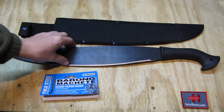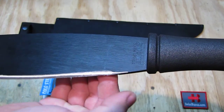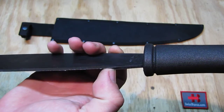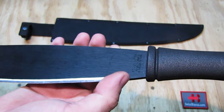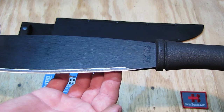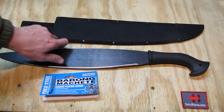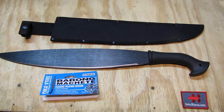What is also not ideal is the grinding line here — we can see they slipped a bit. The bottom grind line goes to here, the top one goes to about there. I'm going to rework that part a bit. It works as a tool, but when you resharpen you would like a sharper edge where the sharpening stone actually starts on the item. I'll do that quickly on the grinder — just need to make sure not to overheat the steel — to get a better starting point for resharpening.